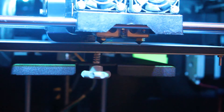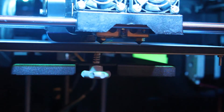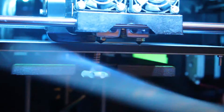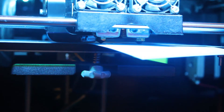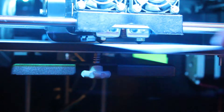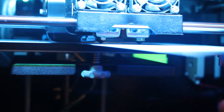I've actually got some previous extrusion sitting on the left extruder — the one I'm going to use — so I'm just going to quickly get that off. The FlashForge comes with this handy piece of paper, basically just a regular old piece of paper that you slip between the nozzles to find out how close they are. It's just a feeler gauge essentially. I'm going to slide this in between both nozzles.